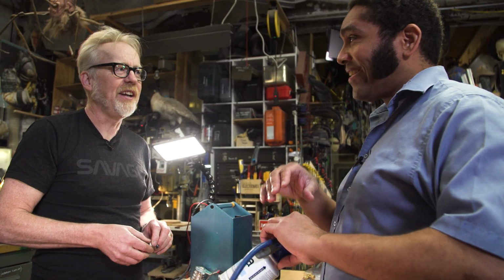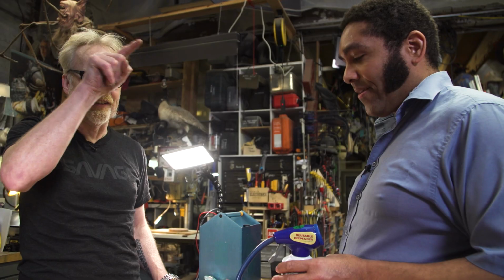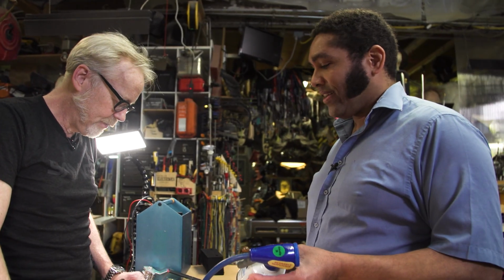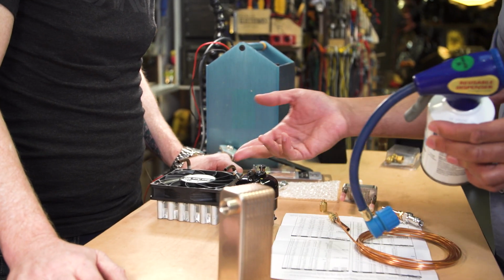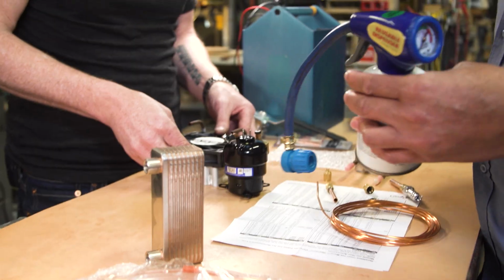Basically every Freon change affects multiple other systems. So it's not just as simple as move this and this happens. It's all these cascading effects. I can change the chemistry of the refrigerant, and that changes everything else in the system. Wow. And understanding what those effects are, or change the speed of the fan and what's going to happen. How much liquid refrigerant do I have left over when the speed of the fan goes up? Amazing. All those things are connected.